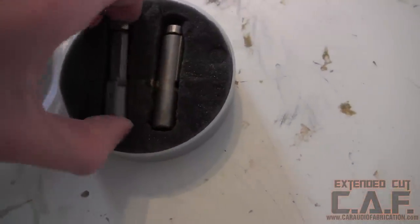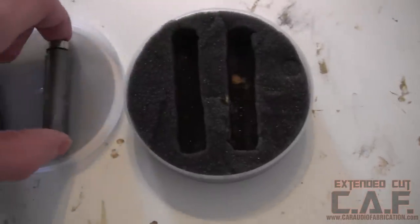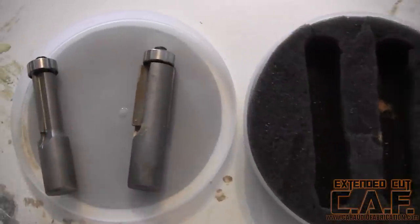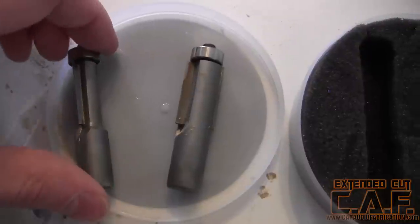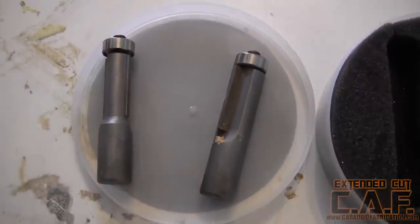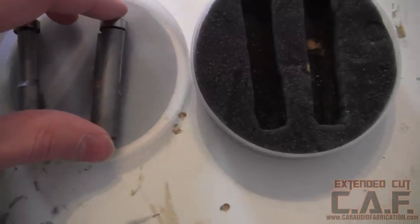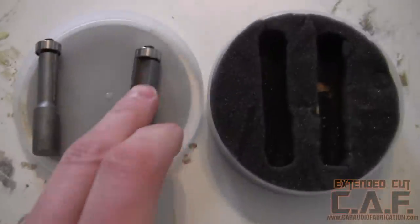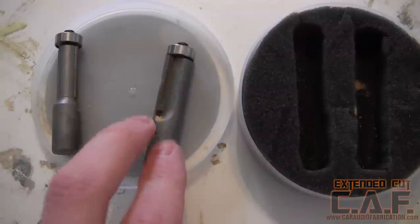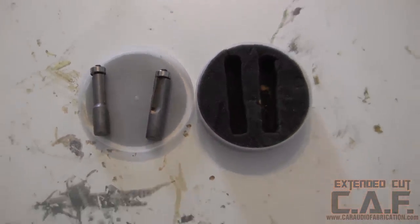Now what the Sonus fit kit bits are, is there are two different bits. One is oversized by 30 thousandths, and the other one undersized by 30 thousandths, which is about the equivalent of 1/32 of an inch. So because of that, I need to gap this for two layers of vinyl here. So each pass of this is one layer of vinyl. So we're gonna actually do two passes. I'm gonna show you guys how that works.